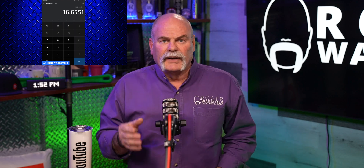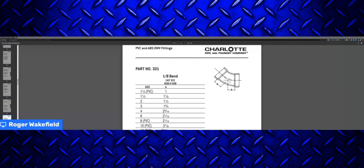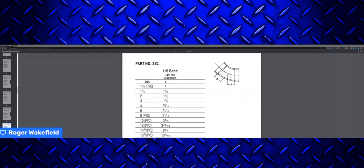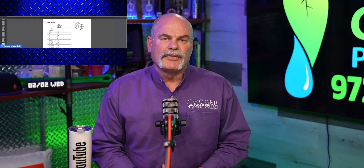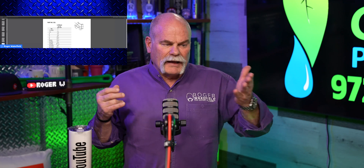One thing we need to remember is to subtract makeup. If you're doing carbon steel fittings, you measure from center to makeup and subtract that to get your cut. On a weld fitting you also need to allow for your gap. For example, I'm looking at the Charlotte Pipe and Foundry fitting book right here — going to PVC fittings, it shows a 45 degree elbow, also an eighth bend, and gives you the A measurement. For 3 inch pipe, makeup on your fitting is 1 and 3/4 inches. Add 1-3/4 plus 1-3/4, you get 3.5 inches. So for a 45 degree you would subtract 3.5 inches to get your exact cut piece.